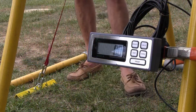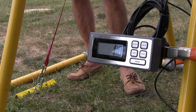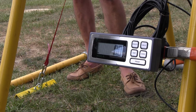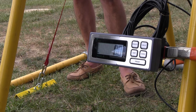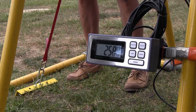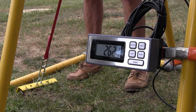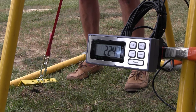They switch to the second product: a unit using four nails and a piece of angle iron. Same soil, same equipment, zero gauge. Per the manufacturer's requirement, it must be pulled at a 45-degree angle matching the nail angle. As the winch loads up, it reads 135 pounds, 168 pounds, 262 pounds — and it starts pulling out of the ground. The maximum reading for this product is 262 pounds.